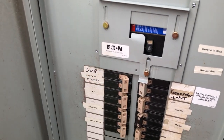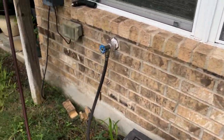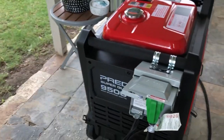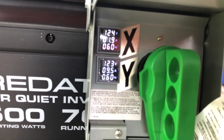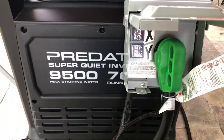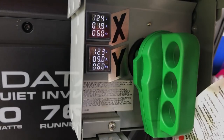There's the sub panel. Now the entire house is on generator power. My particular breaker box has one leg that runs typically about seven amps higher than the other, which isn't ideal. But if you balance it out — like putting your clothes washer and other appliances on the lighter leg — it maybe balances things and lets you work a little more casually in the house.